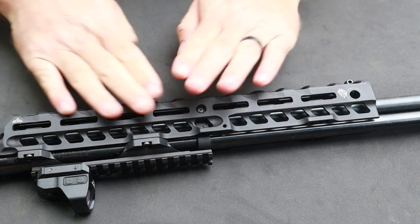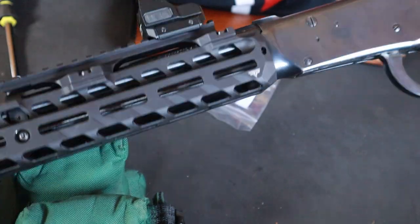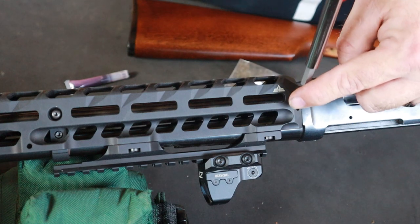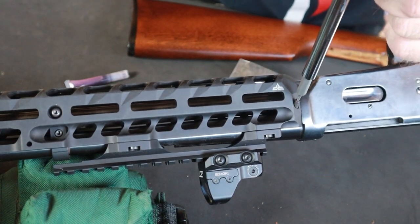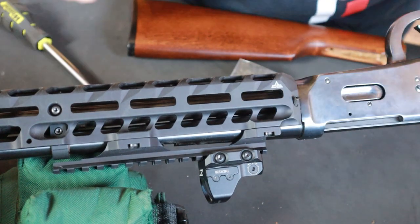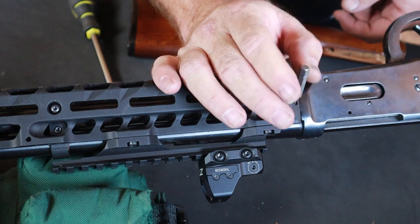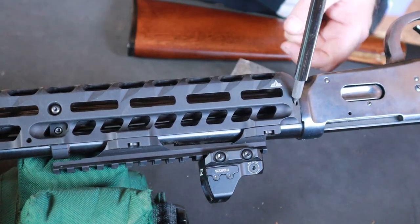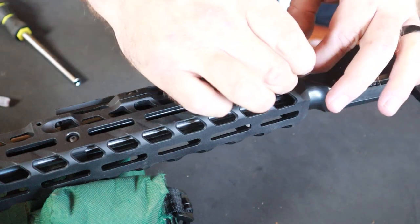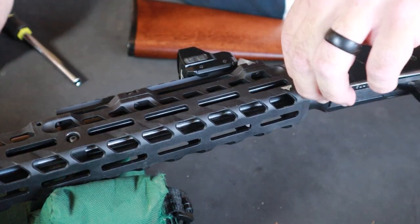The next thing: we've got these two little set screws. These set screws go right here at the end of the rail at the beginning of the receiver — there's a little angled hole here and a corresponding one on the other side. Put just a little bit of purple Loctite on that set screw; it does not take a great deal of torque. This is wanting to cross-thread with that big handle, so take the big handle off — now suddenly I don't have too much leverage and it goes right in. Just give her a little doop — not much. Do it on the other side as well: run that in and don't forget your purple Loctite. Just a little kiss, not much torque at all.